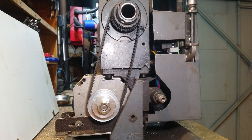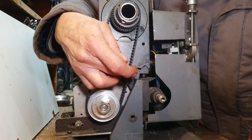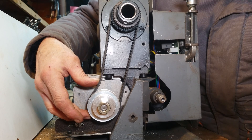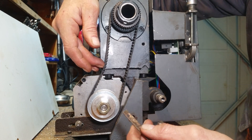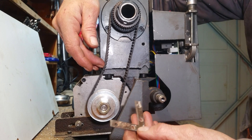Welcome, or welcome back to Harris. This week we're carrying on with the mini lathe project and making a belt tensioner. This is where we left it last week. This belt is really a bit slack — if we leave it like that, my feeling is it's going to skip teeth if any significant torque is applied to the part that's being machined.